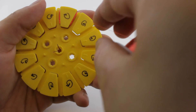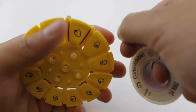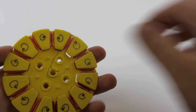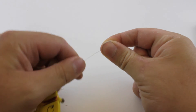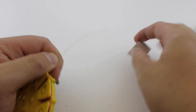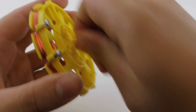Once you've wrapped one tooth, go ahead and move on to the second one, but make sure you change directions. Now that you've completed all the wraps on every tooth, take that piece of wire and clean off the insulation on the end with a piece of sandpaper. Then screw in another screw next to the one you placed in earlier and wrap the wire around your second screw.